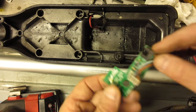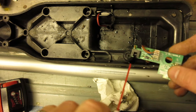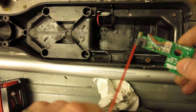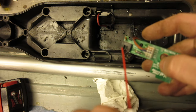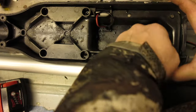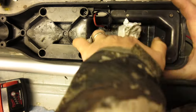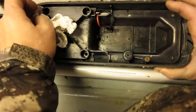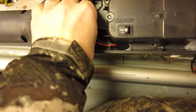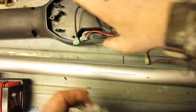While I have it out, I'll make sure the IR sensor and emitter are dry. I'll just give it a little dusting with dry air. You don't want to use air from your shop air compressor if you don't have a dryer on it — you want something that's really dry air. You don't want to be injecting high-pressure water and air into it. You've also got to be mindful of condensation when using canned air because it can get cold. We'll dry out the rest of this housing and then try to seal up this housing as best I can with some silicone or gasket sealer.